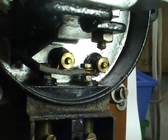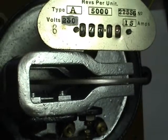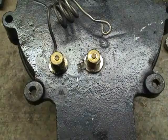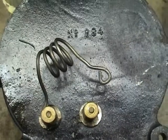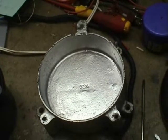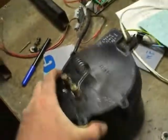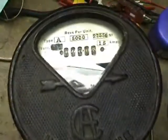Now the terminals go through the back base to a shunt, and these are the connector terminals. For the sake of this test I had the shunt disconnected. Over five amps the meter hardly moves, so there must be a bit more voltage drop, so I'm going to wire another shunt and see if we can recalibrate the meter. This is the back base, and this is the shunt in its normal service position. It's quite a heavy meter and this part fits on top of here.